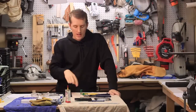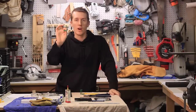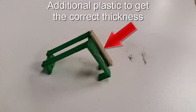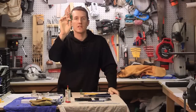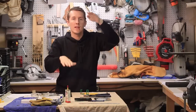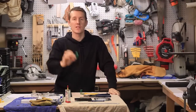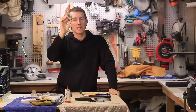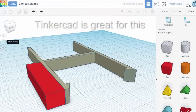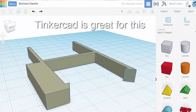Later on, I found another 3D spacer you can print where you don't have to remove that back plate. It has little spring handles on the back where you slide it in through that gap and it fills the space. One thing I learned right away was this was not thick enough for the mirror I was using. I had to glue on a little piece of plastic on the bottom to make it the same thickness. So in theory, however thick your glass is, you have to make the spacer that thick. If you use really thick glass, you'll have to beef it up — glue on a piece of plastic or go into a CAD program and thicken it up however much you need.